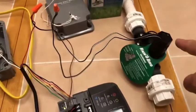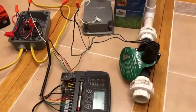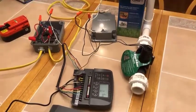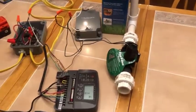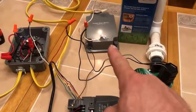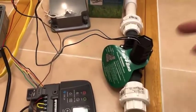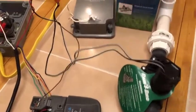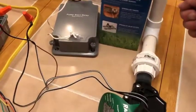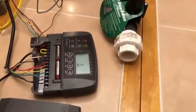So now at 8:50 this is going to trigger off — the light's going to come on, then you're going to hear the solenoid going. You can see that the pump is triggered on, representative of that light, and you can hear the solenoid going. This would basically mean that this valve is lifted up, letting the water come down here into the channel and out the zone, watering your line.